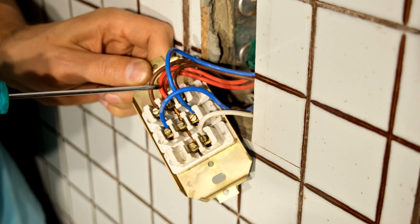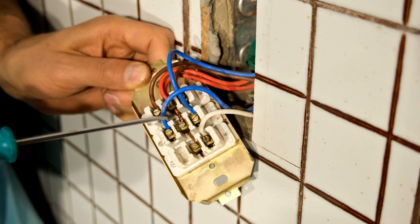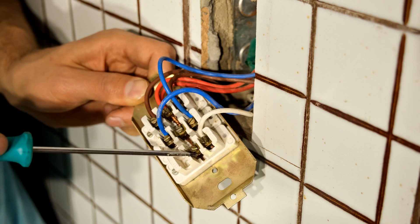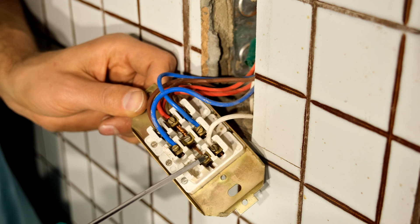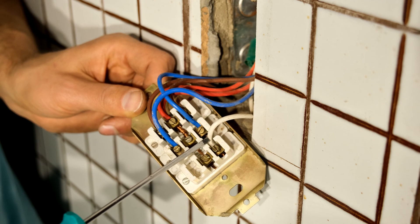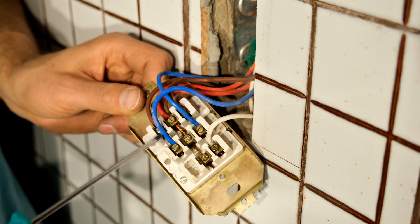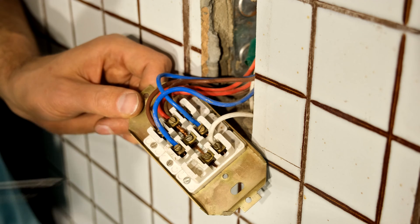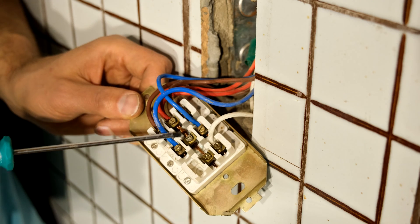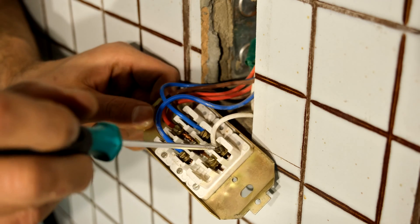As you can see there's a red wire going to each switch. This is common to all of them - that is your live wire. When you close the switch you are closing the live onto the wire going to your light fitting. All I need to do is remove one circuit and put that wire onto this one, because this is the wire going to the main kitchen light. In your case you'll probably find there'll only be two terminals on your switch.